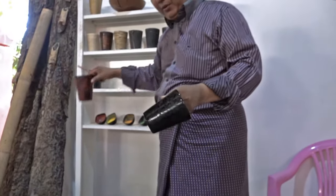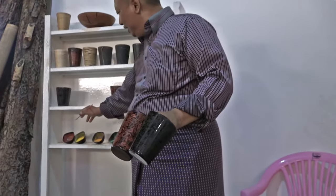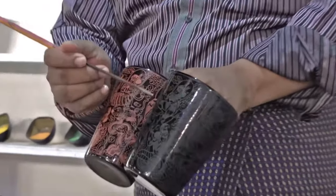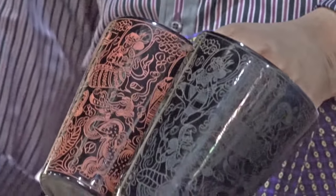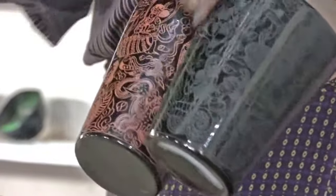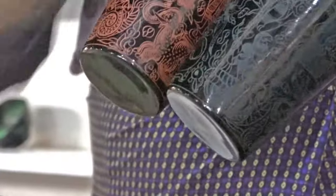When we put the red color after carving, we mix red mineral with lacquer. We do not paint with a brush — that would take too long. Instead we apply the red color by hand all over the carving everywhere, and after drying we wipe it off.